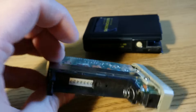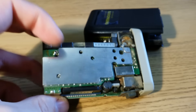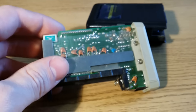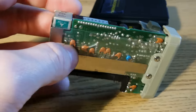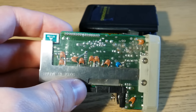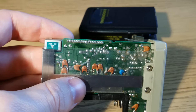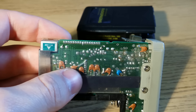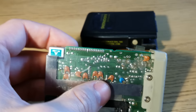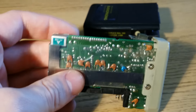There's not really a lot to see until I take the two boards apart. There's a lot of shielding on here. All of the radio frequency signals are going to be analogue, so there's no digital on here at all apart from the display controller. What I can see is a lot of small ceramic capacitors, and I'm not sure if they're bodges or whether it was intended. They all seem to be connecting onto this piece of shielding material — whether it didn't quite pass RF standards or there was some problem after design, I'm not sure. There are also a couple of bodge wires but apart from that it's a very well designed piece of equipment.